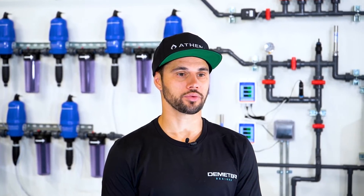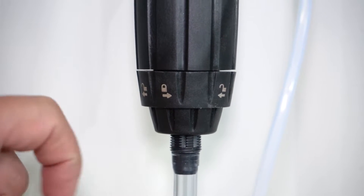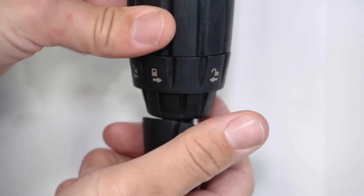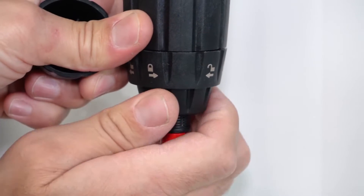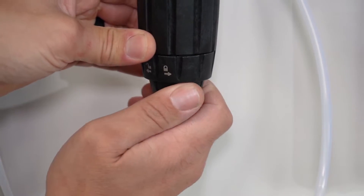Check valve. On the bottom of the stem there are three locking rings: the top ring is the injection rate setting lock, the middle ring is the check valve locking ring, and the lowest ring is the pickup tube locking nut. On the MZ2 models, the middle ring is underneath the lower pickup tube locking ring. When installing new Dosatron units, make sure the check valve locking ring is fully tightened. Completely loosen and remove the lower pickup tube locking ring to expose the middle ring, then snug it to ensure the check valve is tight. The check valve is a common replacement part in routine maintenance. Please remember these units are made of plastic — do not over-tighten any threaded connections. No hand tools should be needed during the setup process.